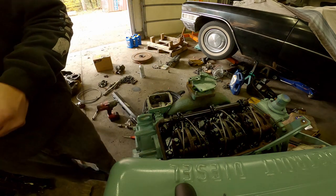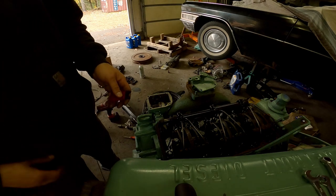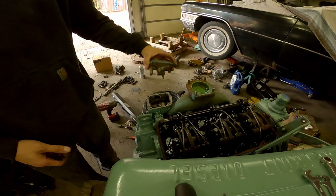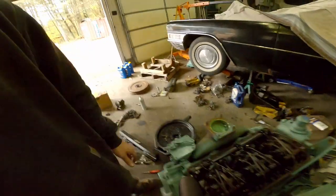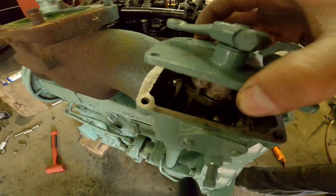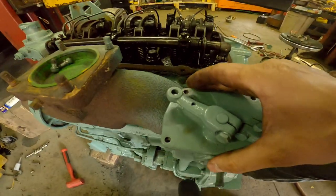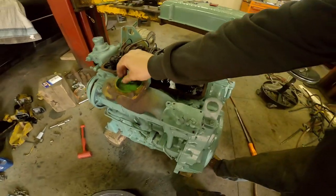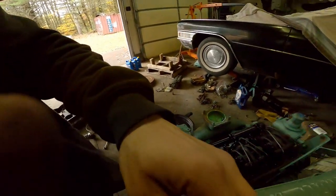That's perfect — that's where we're going to go with it. Now that our gap is set, we can set our cover back on. You always want to make sure when you set the cover on that you get the tang in the fork down there — see that? There'll be resistance on it and your rack will move when you get it right.